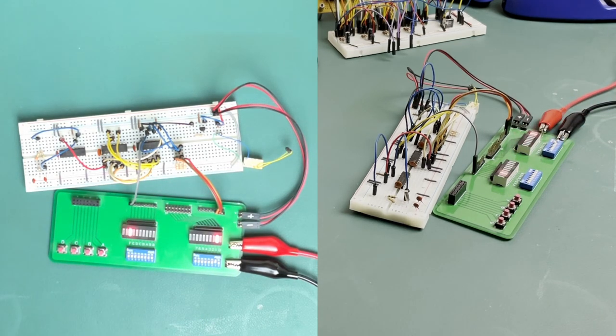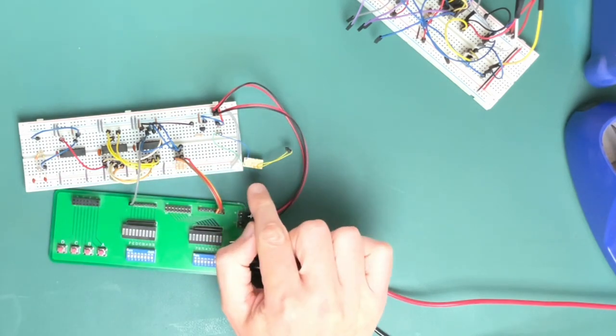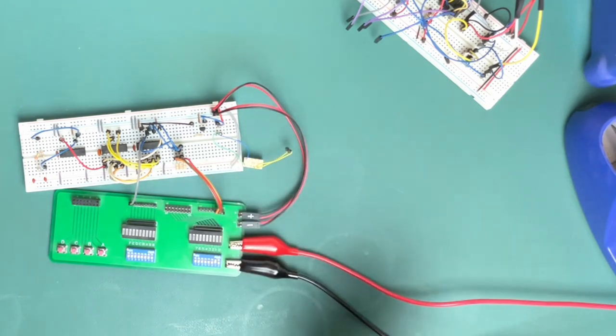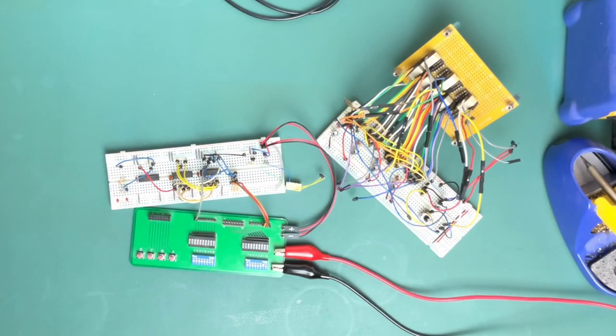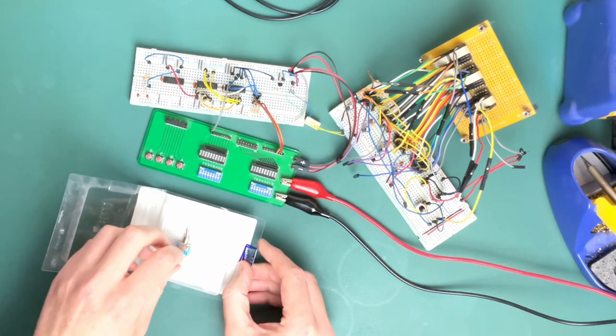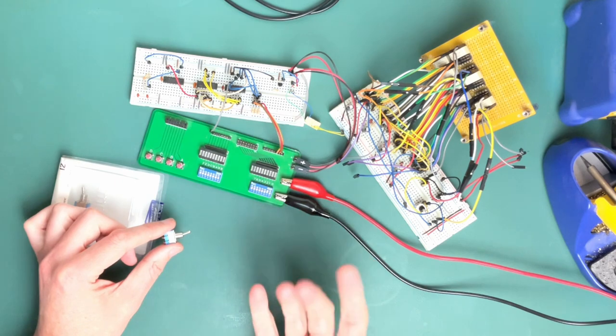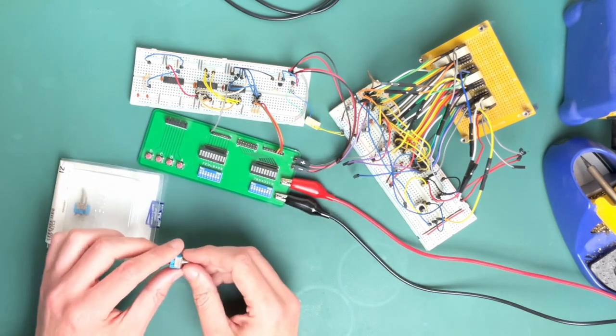So that is pretty much the crystal circuit complete. We need to implement the halt line for this circuit, but the easiest thing is probably just to kill the power and only let the freeze line come through when this relay is off. That'll make sure that if it's on a clock cycle and the freeze line is set, it'll keep going until it gets to the off state and then turn the power off to this clock - much simpler than the relay one. In terms of controlling which clock will be turned on, we have a switch so we can turn on the clock power for the halt clock. That'll mean we can disconnect if we want to use the computer without the clock, manually clock it, or do some debugging.